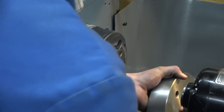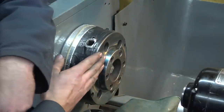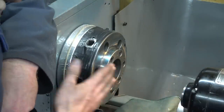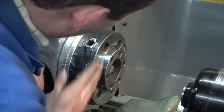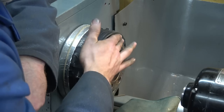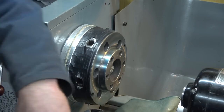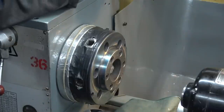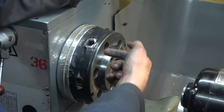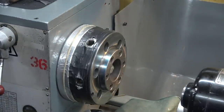What took so long? Well basically the limitations of the tool post grinder are horsepower, and also that wheel I've been using is a very fine grit. Just trying to work your way back — I've probably taken five, six, seven thou off since I started this morning and that has been enough to tie up quite a bit of time. But it's done the job. I'm now going to see whether or not I have ruined this whole thing altogether. I'm going to put the draw bolts back in and see if they still correspond with the tightening — hopefully the amount I've taken off is not enough to have upset the system.